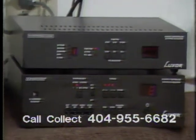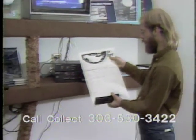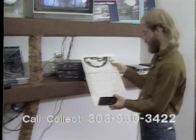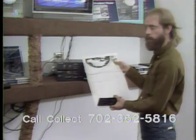Now prior to doing this, refer to your satellite services listing and find an odd and an even channel that will be easily recognized on all of the satellites that you intend to program in. For display purposes, I am only going to program Galaxy 1 and SATCOM 3. And I have picked channel 7 on Galaxy as an odd channel, which is CNN, easily identified, and channel 12, which is Home Team Sports. So I have an even and an odd channel. On SATCOM 3, I will look for channel 4, which is FNN Sports Time, easily recognized, and MTV channel 11.